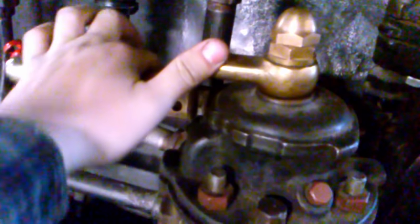Now let's take a look at an H6 automatic valve in 6ET, presently in release. As we bring it toward us, that's now running. Engine hold allows your independent to remain set. Moving past the bump gives us lap, which holds our set. Moving to the right gives us service, back to lap to hold, then back to service to add more. We can release it by going back to running. And here's the fun one — slamming the valve all the way over to dynamite.